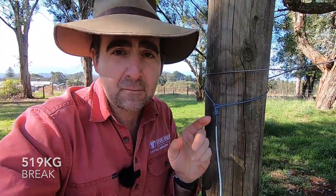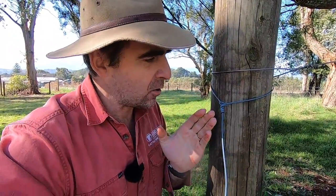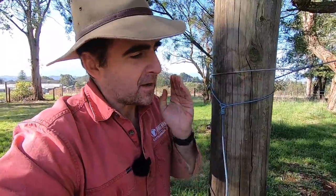So summing it all up, what have we learned about end knots? Well, we've learned that a neat one won't slip and lose line tension before it breaks, but a sloppy one will. And that's the whole job of the end knot — to hold your fence firmly in place, and when something impacts against it, not to move and allow the fence to get slack. A sloppily tied one will allow the fence to get slack, but it does have a slightly higher breaking tension. To be honest, an untidy, badly tied end knot is not doing its primary job of keeping the fence together.